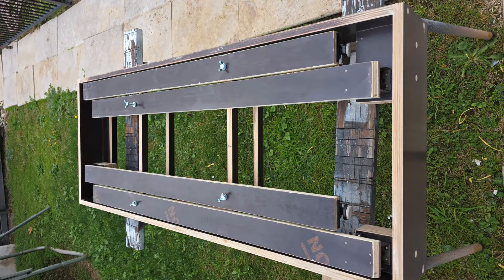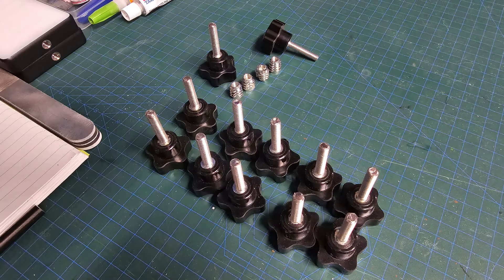This next picture shows how each of the legs fold down — you can see how they're offset to each other. I used wing nuts to tie down the legs into those M6 inserts, but I did actually change them out for another type. I swapped the original wing nuts for the Richmond M6 hand bolt from Bunnings. You can also see the inserts I used — it's just a matter of drilling out a certain width and screwing those in. I put a bit of glue in there as well when I screwed the inserts in just to make sure they weren't going to move. The reason I switched to these ones was they were just easier and quicker to undo and do up.